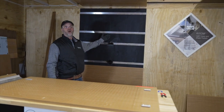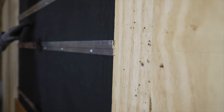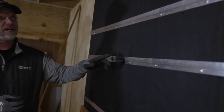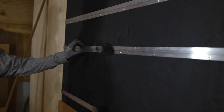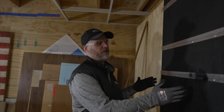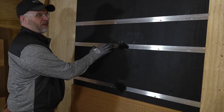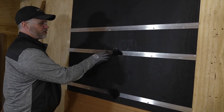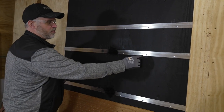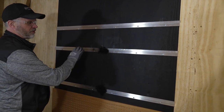On the wall is where we have the z-bar, which will run coast to coast. I sprayed the plywood black first so it would show through the reveals. Running the z-bar continuous and spraying it black in the reveal area helps with installation and support — because if your stud spacing is 16 inches on center, the end of your z-bar may not have a solid attachment where the reveal falls. Running it continuous, anchored to studs or plywood, and spray painting the reveal areas lets your z-bar stay continuous.